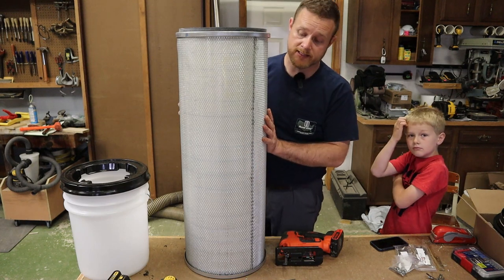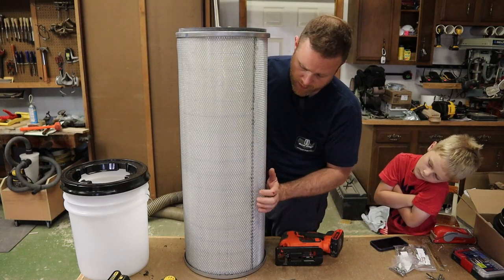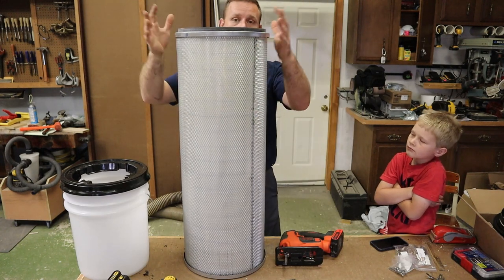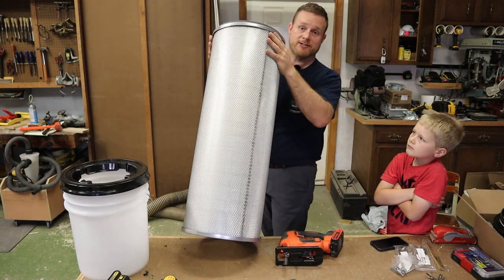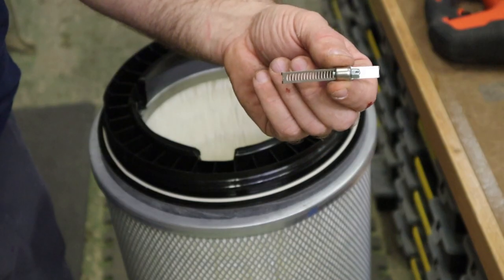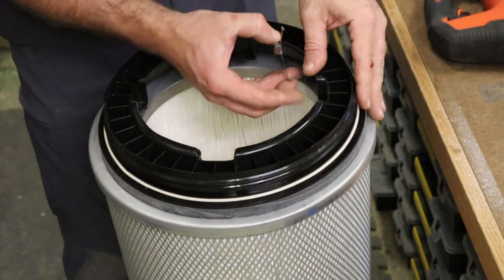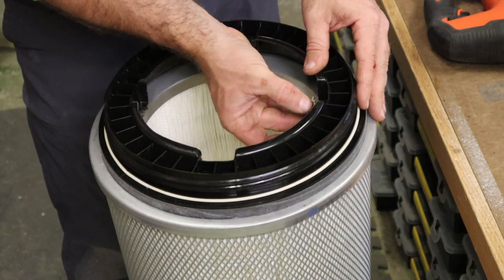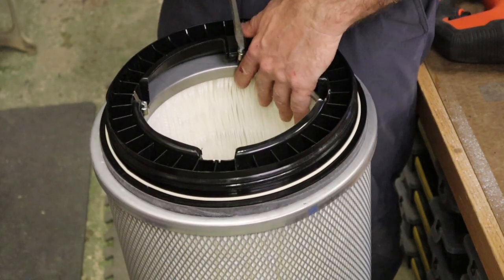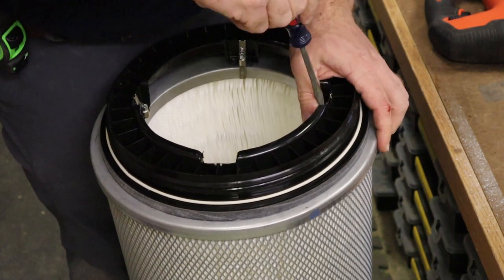Be very careful handling this — the manufacturer recommends wearing gloves because there could be sharp edges, like where the seams connect on the cage on the outside and the filter on the inside. On the top side, the filter comes with a gasket. Wynn Environmental sells clips that are very similar to a hose clamp with two little hooks on each side. Right where you drilled your 5-1/8 inch hole, it slides in and clips on the inside of the filter and on the bucket, and then you tighten it up. Don't tighten it so tight as to distort the plastic — that can cause an air leak — but get it good and snug.